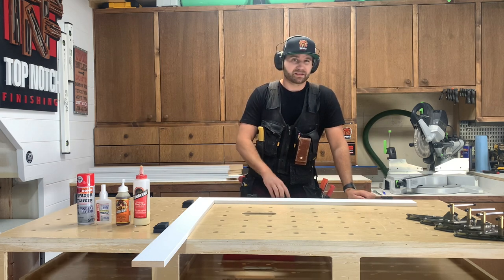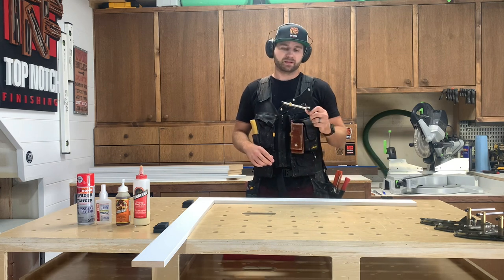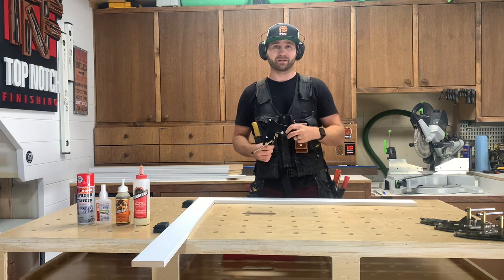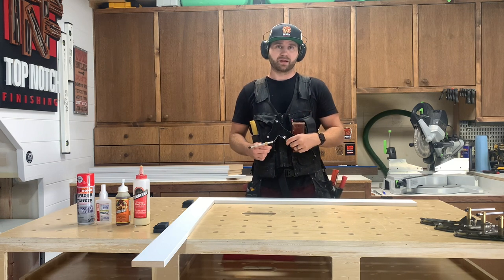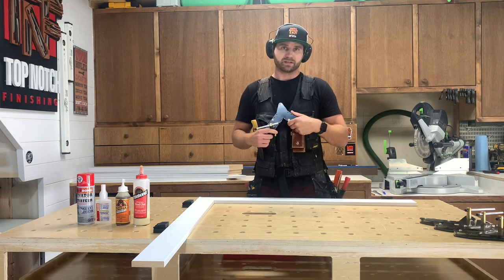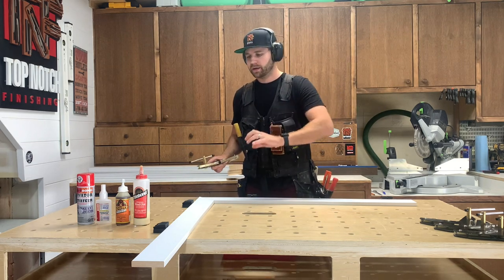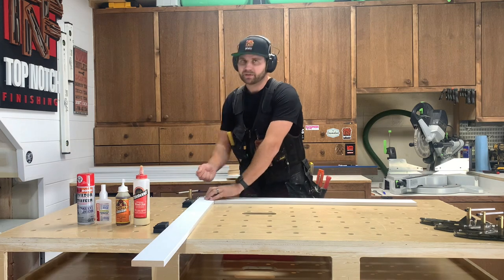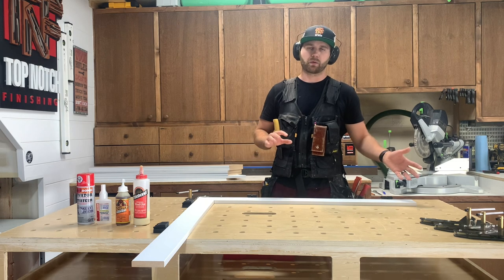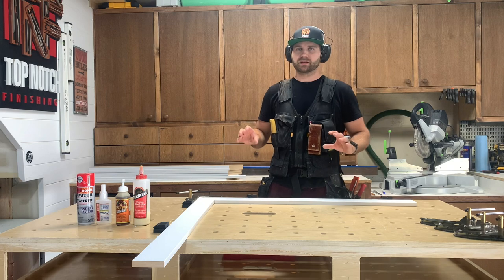What I've done in the last six months is I started incorporating clam clamps. This is a clam clamp knockoff because it's very hard to get in Canada and very expensive. And now with COVID and everything, it's even tougher. I will have a link in the description of where I bought them. What we did now was we glued them up on the wall, clamped them, and walked away — took them off the next day or after about four hours if we needed to move on. You need a lot of them, so it's a big investment.